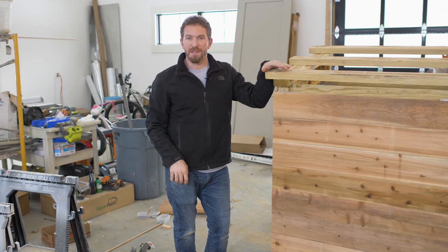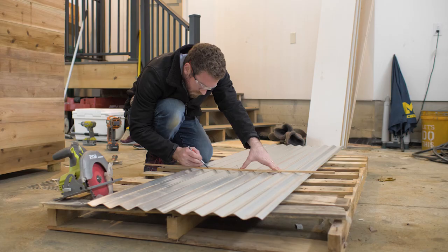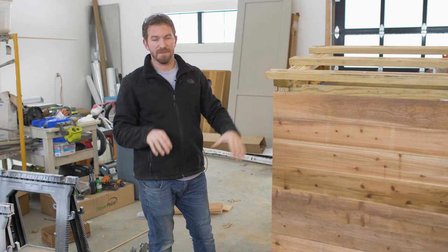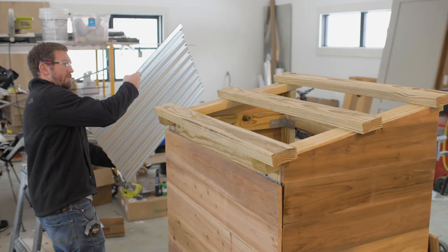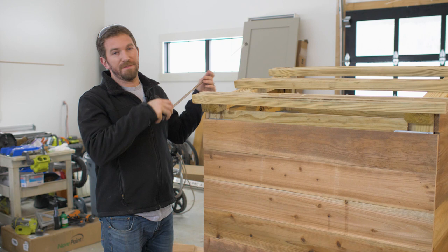Now it's time to put the roof on, and what we're going to be using is corrugated metal with a natural steel look, which I thought would go well with the natural cedar. I've got 32 and a half inches across front to back and I'm going to overhang it by an inch off the back and front as well, so 32 and a half plus two is 34 and a half. To cut the metal roofing I used a circular saw with a blade made specifically for cutting metal, though you could use a grinder with a cutting wheel or tin snips as well.